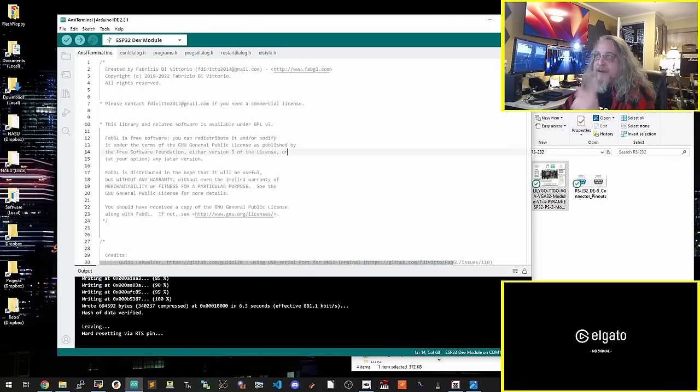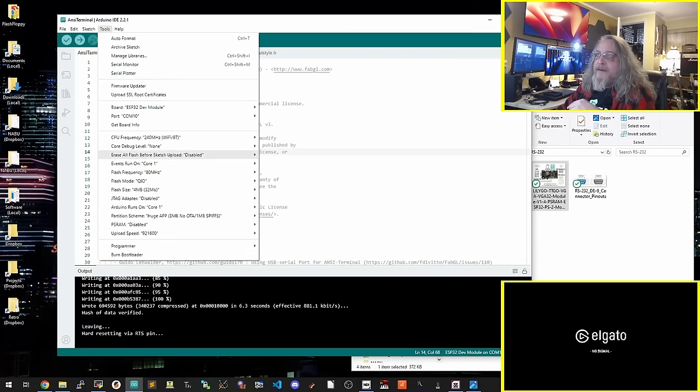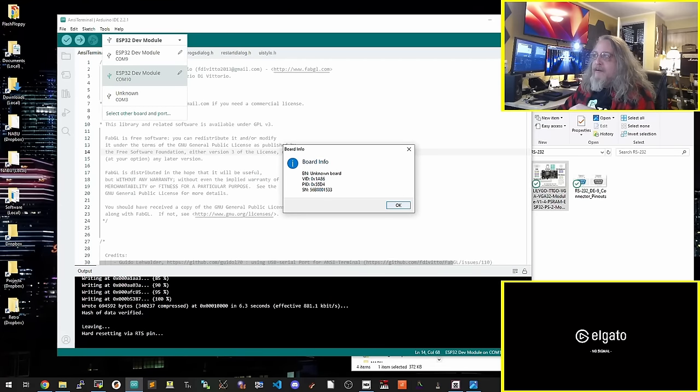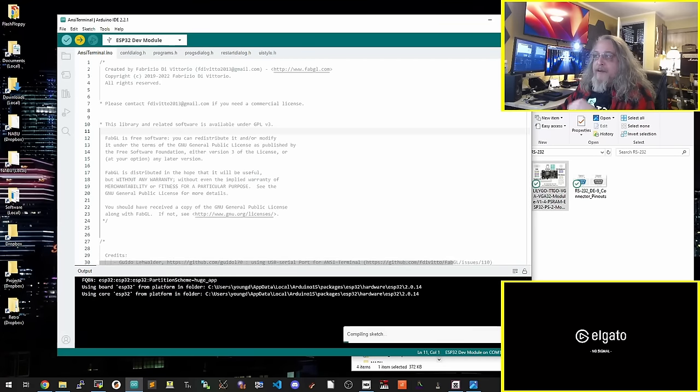And then select your COM port. I think I'm in COM 10 on this one. We'll find out in a minute. You know, let's just see. Let's do a get board info. All right, well, we can get the board info. Build it and upload it.